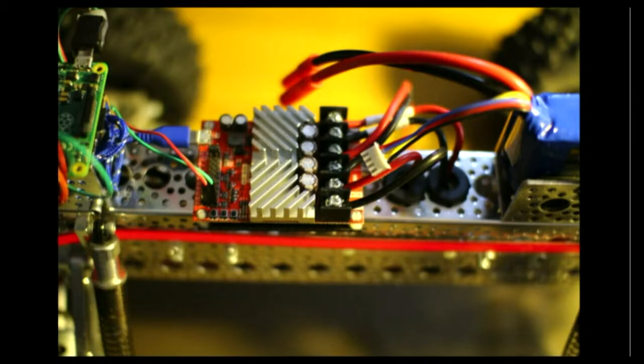For higher-amp robotics I use the Roboclaw controller, which I've been discussing with the manufacturer. It's a 45 amp per channel controller, so with motors that stall at 20 amps, it can well and truly handle the amperage. One of the things I discovered when I started blowing up electronics was that if you don't fuse a circuit, part of your circuit is actually a fuse — you just don't know what part. The battery, wiring, and motor controller can all handle the stall current. When it stalls, I'll just get drivetrain damage. But I need to detect when I'm pulling 40 amps per channel and cut power.